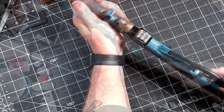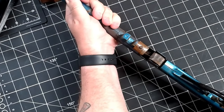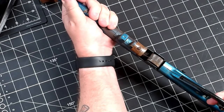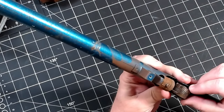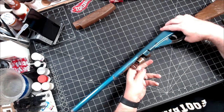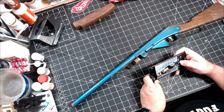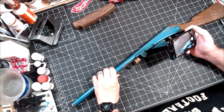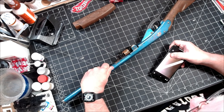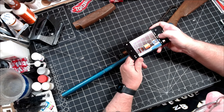Here you can see the whole little noisemaker mechanism. This particular rifle has the main spring in here that gives it a kick and a pop. When you pull the trigger, that spring will spin that little cog, and that will vibrate that little wire, and that makes a noise. Then that little cylinder in front is actually like a drum — a drum shell with a drum head — and that little wire drums on that. So you've got the main spring releasing energy, giving a kick and a pop, spinning that little wheel, the wire on the wheel making noise, and the wire vibrating on the drum making noise. They've really put a lot into this thing. Very simple, yet ingenious — you can see how long it's lasted.